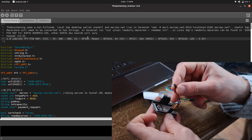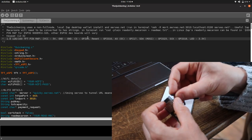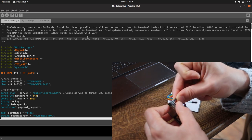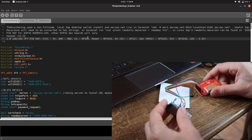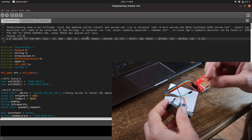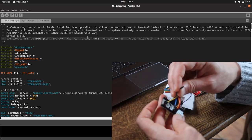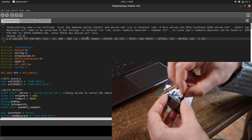Then SDA on the yellow wire — SDA is MOSI, our data line — plug that into pin 23. And then green SCK on pin 18, which is next to the brown one next to pin 5. I tried to clump these together.